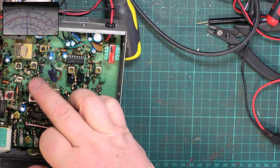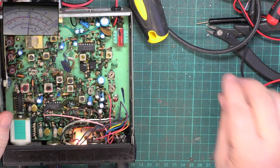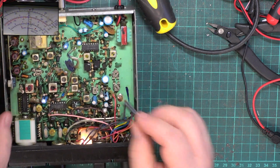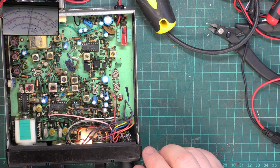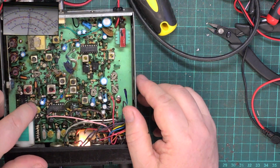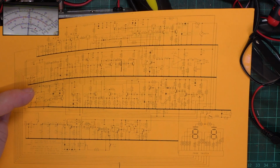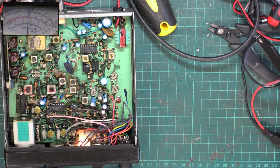That looks like some kind of modification, but I really don't care. Anyone noticing the F and the G filter, it is supposed to be the F and the G filter. They're not supposed to be equal. So, 10.24 is the crystal here. So, let's just see where that's put on to. It's between pin 3 and 4 of the synthesizer chip.